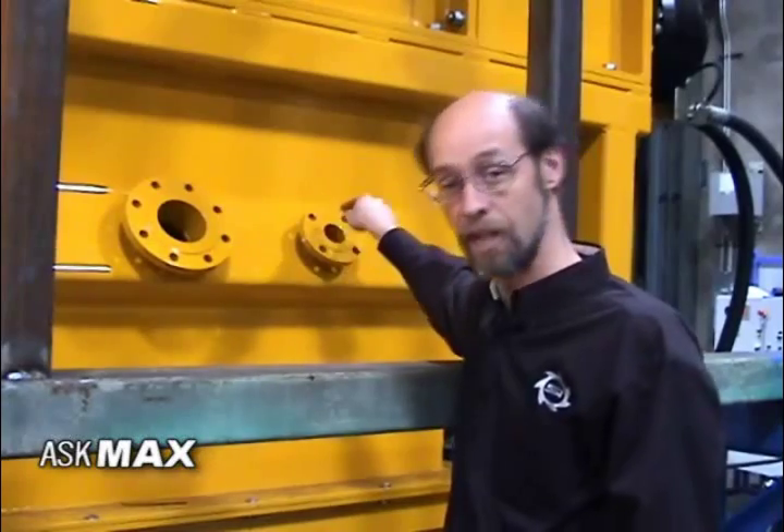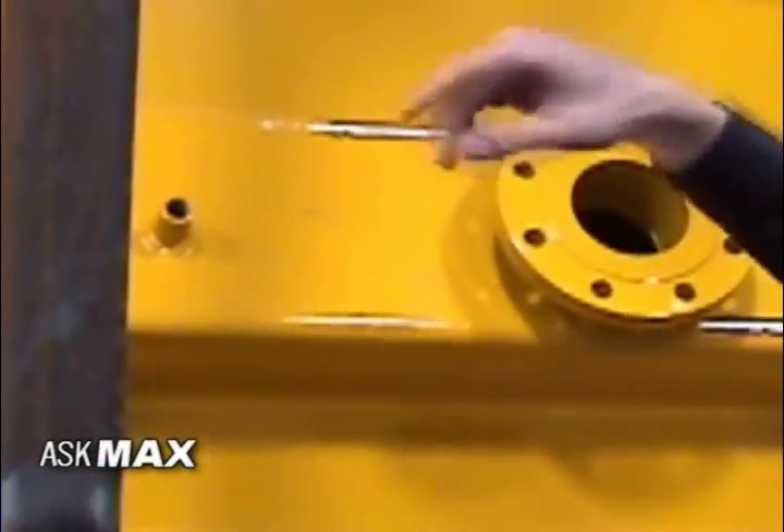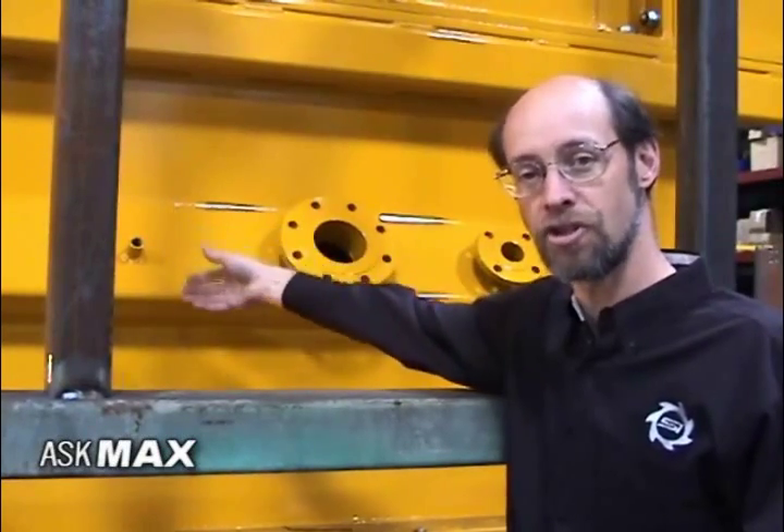This machine is designed to shred material under a nitrogen environment. We actually provide nitrogen in there to displace the oxygen out. This is an exhaust port where we allow the air to come out as we're introducing nitrogen. This port on the other side is an oxygen sensing port where an oxygen sensor pulls atmospheric samples out of this chamber and allows the shredder to process after the nitrogen has made the situation safe.